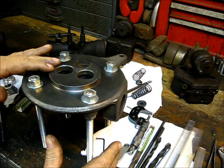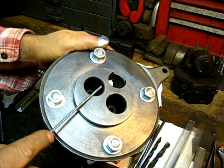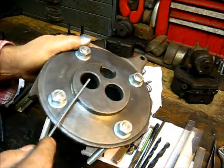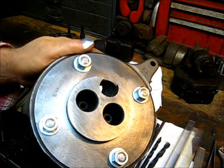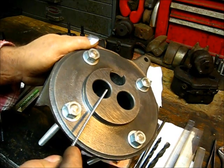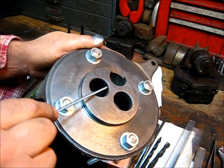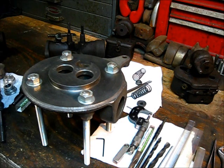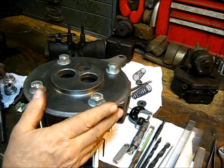These valves here — that is a one-angle valve seat. A three-angle valve seat, which so many people rate highly, is nothing more — and this is in the book, don't quote me, quote the book — you cut the seat as we have it here, then cut a different angle on the top edge, then a different angle on the bottom. That's a three-angle valve seat. It pays a little more money to sell one, but this came from the factory.